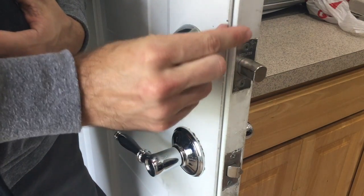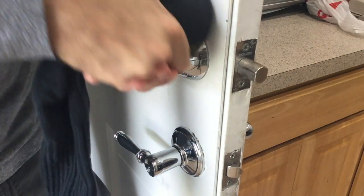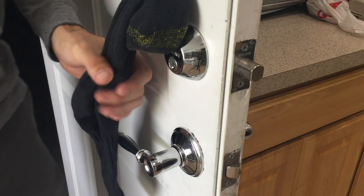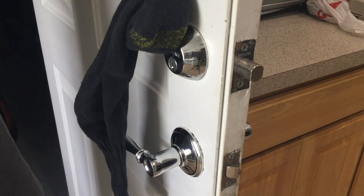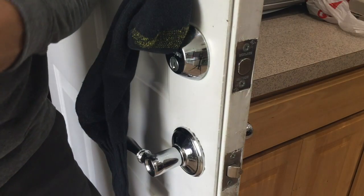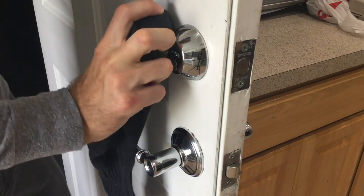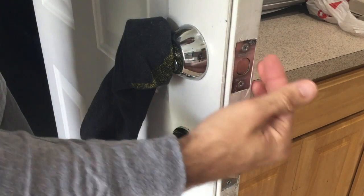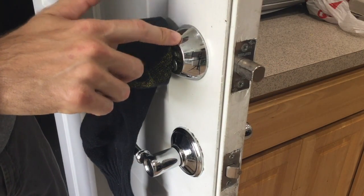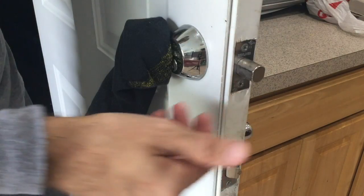Let's say I can partially get this to work. I'm attacking this door, I can see the bolt from the outside — I can see that gap in the door frame. I've tried to walk it in and it doesn't work. I've tried the magnet technique and that doesn't work either. But what does work is that if I can get the bolt to move just that eighth of an inch, I've defeated that elbow lock mechanism. Now I take out my knife carefully, bite into it, and start walking it in. A lot of the methods I teach are three parts: the technique — the magnet — then the reason the magnet won't work, whether due to pressure on the latch, a metal door, or a different type of installation. And then I'll show you a way to overcome that defeat as well. So it's like an attack, a counter, and a counterattack.